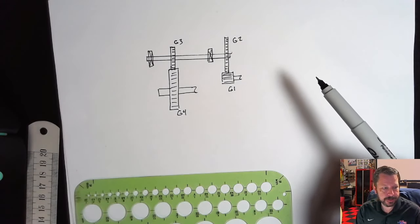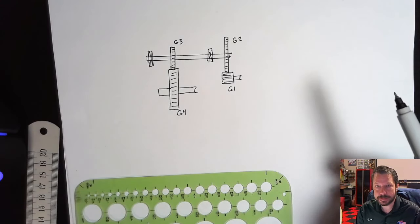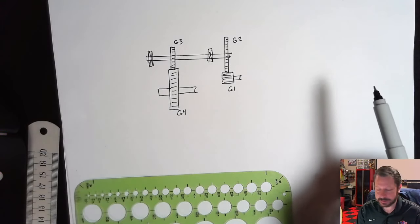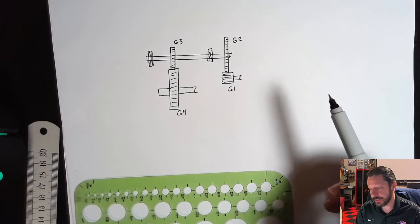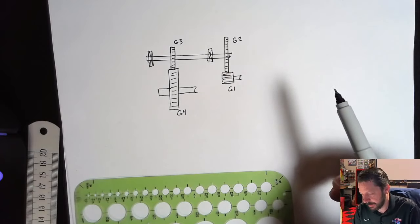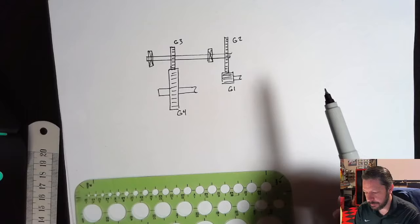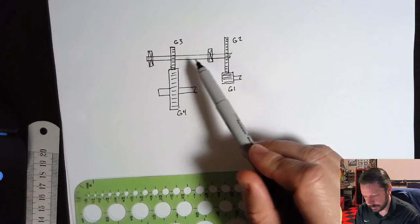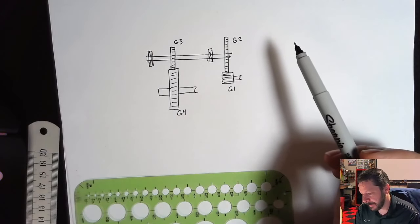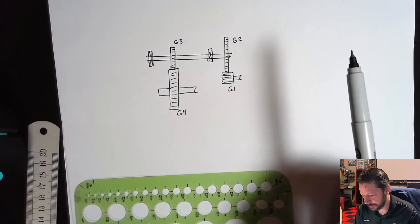And then there are a lot of stress concentration factors you need to know. Those you just look up in the book. The problem statement does give you some guidance if you read carefully, on which ones to use, the first iteration guesses and things like that. That's relatively straightforward. Then you have to start figuring out the moment that's causing bending, so you want to draw the shear and bending diagram. And that's where most people start having a little bit of trouble.